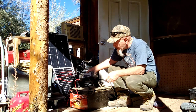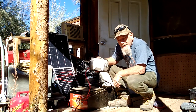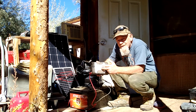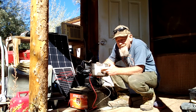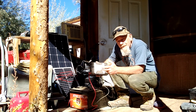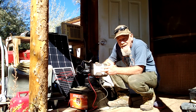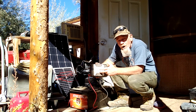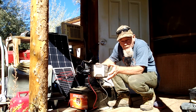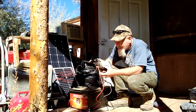I also used a very cheap Energizer 500 watt modified sine wave inverter, and this thing has been running 24 hours a day, 7 days a week for 10 years and it's never given me a problem at all. It's only 500 watts and only modified sine wave. The inverter I'm going to be replacing it with is made by Weize — that's W-E-I-Z-E — it is a 1200 watt pure sine wave inverter, so it is safer to run some larger appliances and I'll be able to get more power out of my system. But this inverter still works really well and I'm keeping it for a backup.